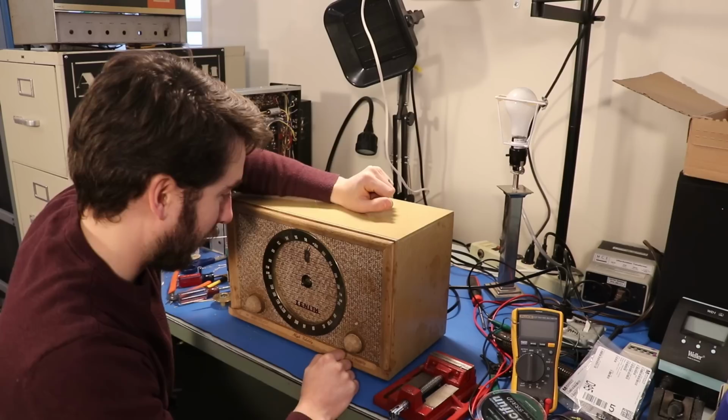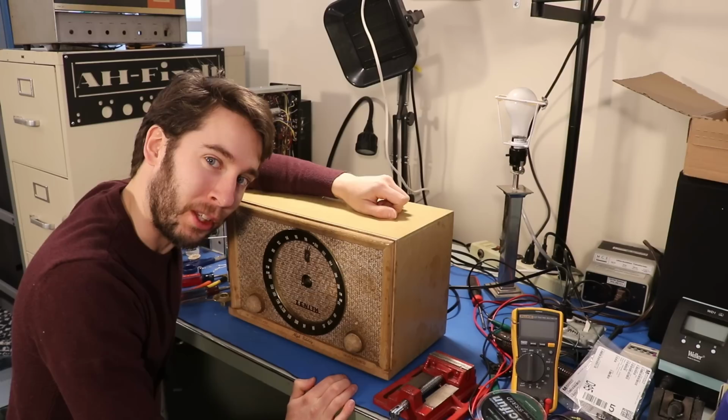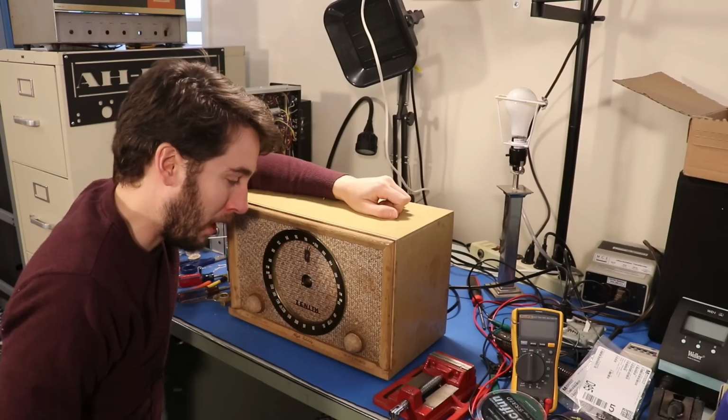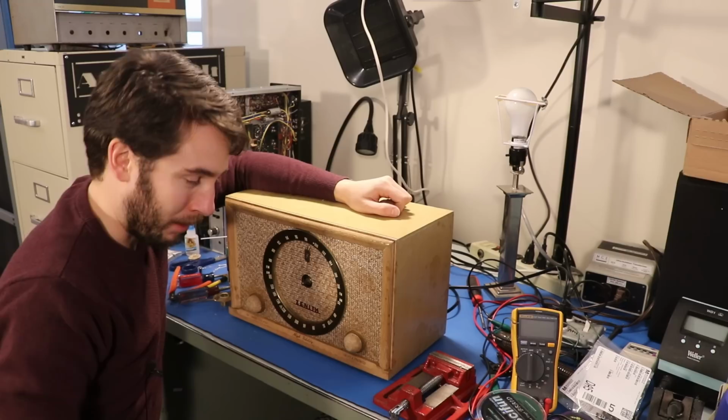I owe a big thank you to all of you who commented on this video, because without those comments, without that feedback, this wouldn't be working as well as it is right now, and it wouldn't be as safe as it is right now either. We got rid of all the problem things, the selenium rectifier. They're known to fail in nasty ways, I guess. We've got that bumblebee capacitor out of there. We've got a fuse added. This thing works so well, and it sounds even better than it used to. Let me know in the comments if we're going to blow up the output transformer with that little tweeter.